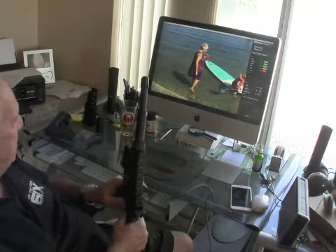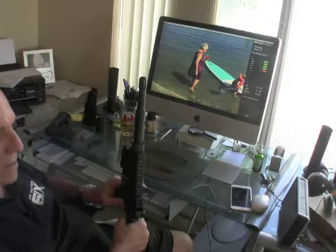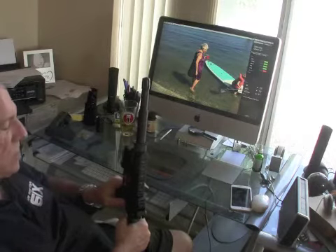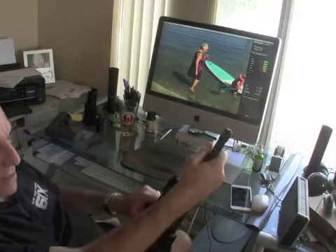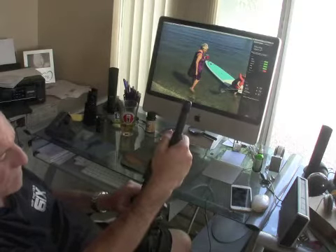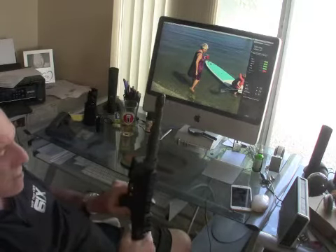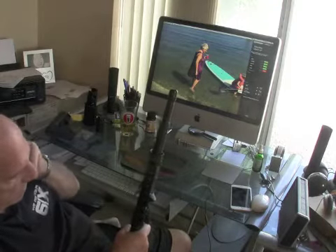Adams Arms didn't really stand up to the task even though they built the system — it was horrible. The Picatinny-style gas block they use only has three gas adjustments, all of which still funnel some gas back into the chamber. There's no front venting of any kind, so basically you turn down the system to suppressor mode and it just sends more gas back into the chamber.